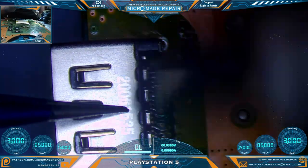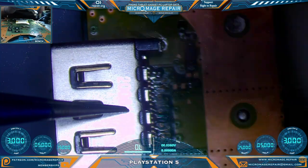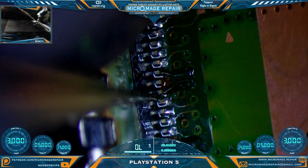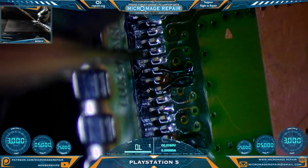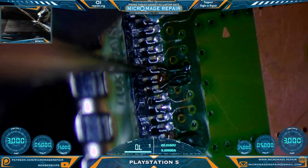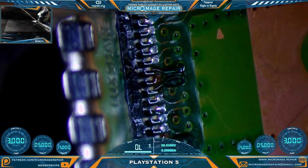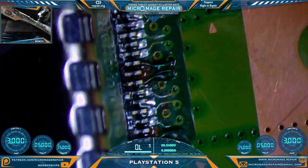Press it down. Make sure everybody is wetted before we let go — we've got to wet the solder on the pins too. There we go, starting to suck up that solder. Hold it down while it dries. Let's investigate how we did. Connected. Connected. Connected. Excellent. Check our non-ripped pads. Okay, this one needs help — that's one of our partial pads. It looks like that is it. We have one that needs help there. Excellent.